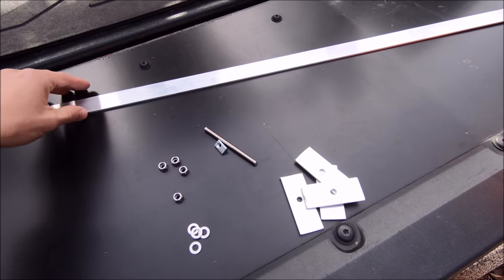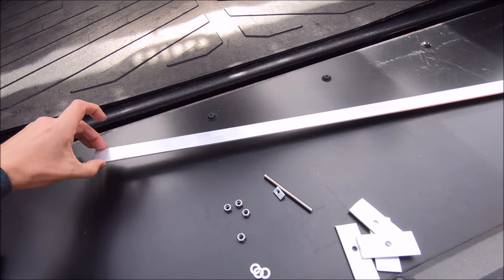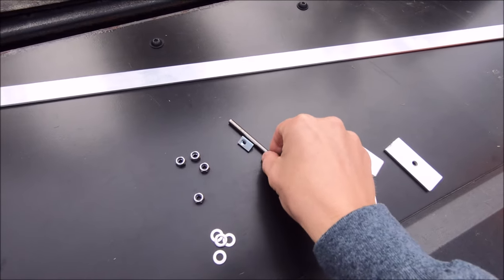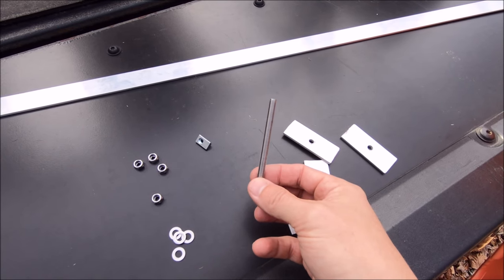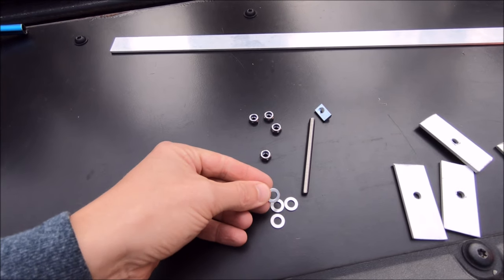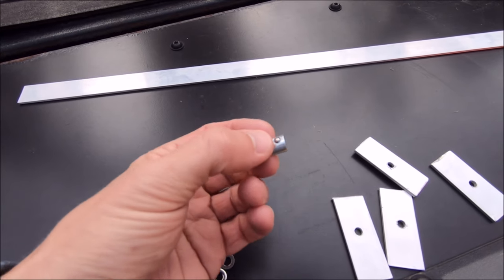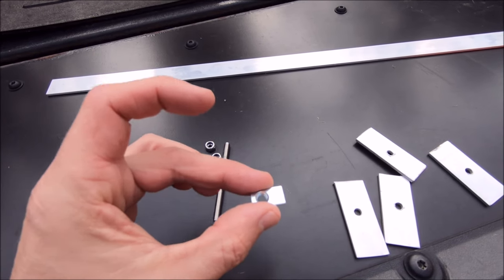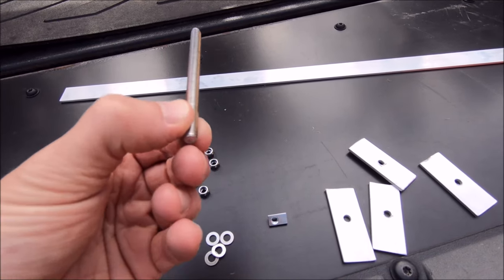Right here you can see this is all I'll be using. I got this aluminum — it's one inch wide flat bar from Home Depot, just a few dollars. I already cut up a few blocks about two or three inches long and drilled a hole where I will install a stainless steel threaded rod — 80 millimeters long. With a few stainless steel washers and nylock nuts, this will all be attached to the rack with these spring T-nuts. They have a ball on the back so they slide easily into the channel. The hole diameter and thread pitch for everything I'm using is M6 by 1.0. I'll put a link in the description for the stainless steel threaded rods — you can get these in all kinds of lengths.